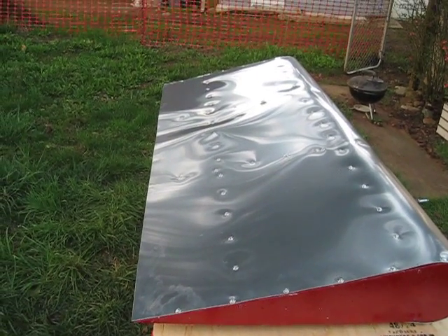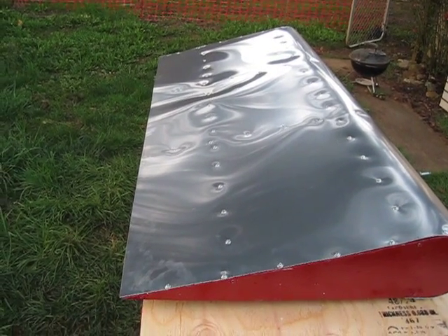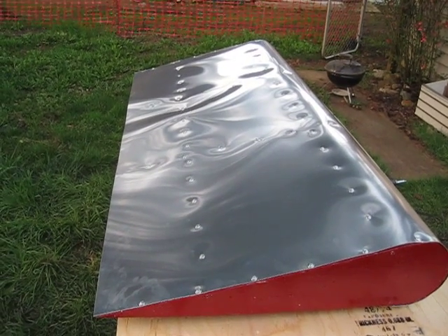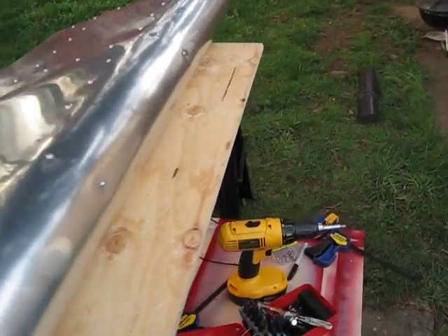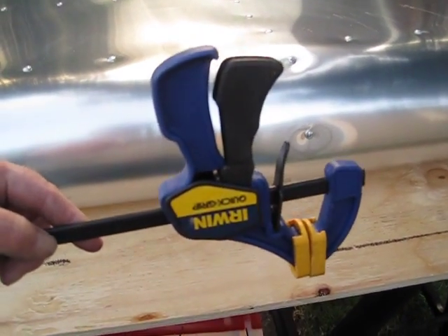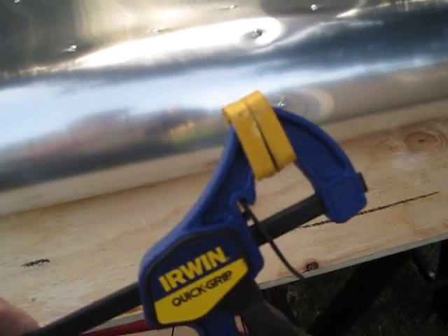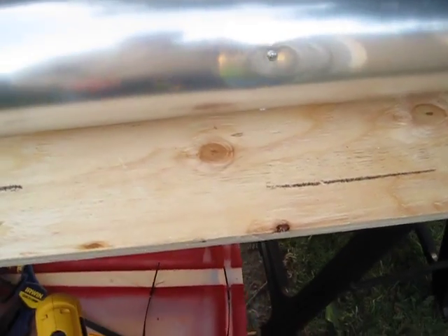First wing done. I also got the magnets glued onto the rotors last night — I'll make a little video about that. I had two magnets slam hard together and actually crack, so I came up with a method using clamps: grip each magnet with a clamp and use the handle to pry them apart. That way if anything snaps it doesn't catch your finger, and it worked like a charm. I ordered four more magnets, two extras just in case.